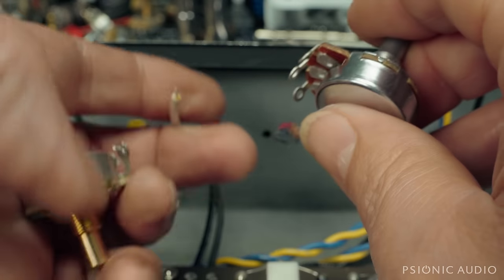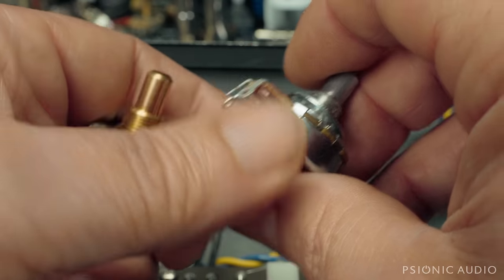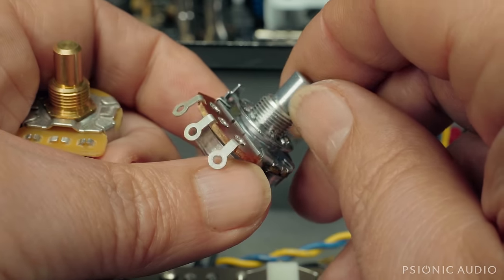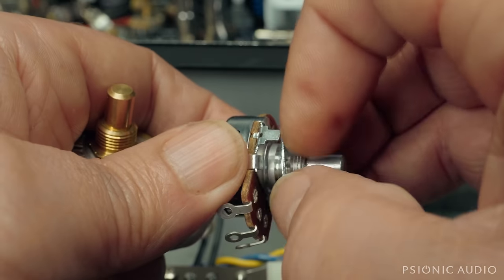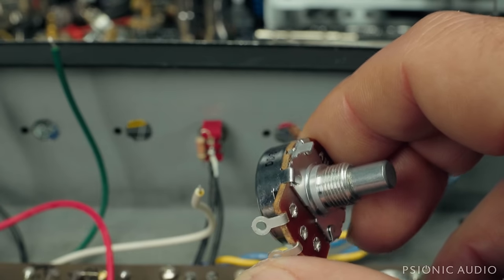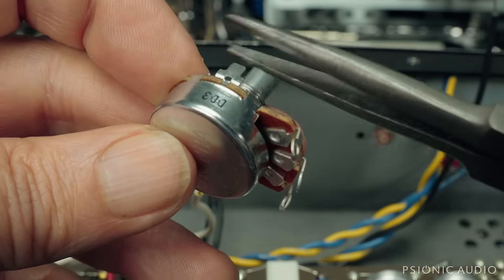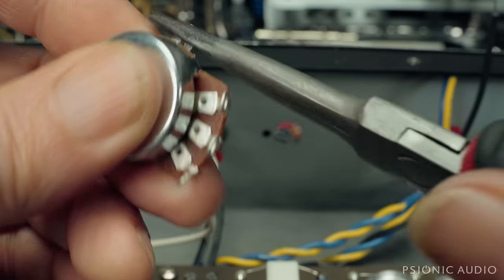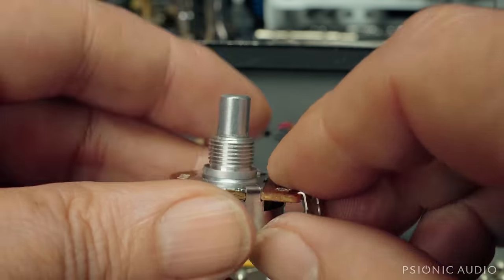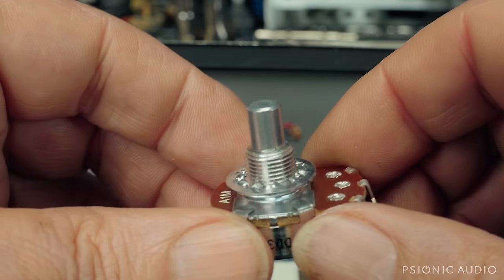You can't torque this as much as you can this brass shaft CTS, and not all CTS have this nice brass shaft. But you can get this material much better than the cheaper metal of the 16mm. This locator tab — the 24mm have it just like the 16mm do. You can use it if you want to design your amp that way, but this chassis is not prepped for that, so I just snap these off. It's pretty easy to do. There it goes — no big deal. With the toothed washer, that gives a really secure connection.